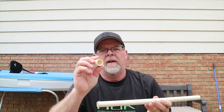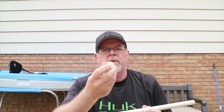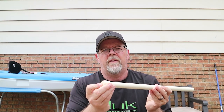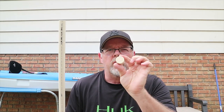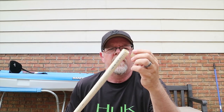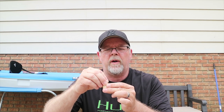With this 18-inch piece of pipe and two end caps, I'm going to drill a quarter-inch hole in the bottom of one cap and fit it on the end. On the other cap I'm also going to drill a quarter-inch hole and fit it on the end. Prior to being put on, I've got the quarter-20 bolts that I'm going to put through. This would be the base — it's going to screw on to the kayak and be siliconed as well so it doesn't move.